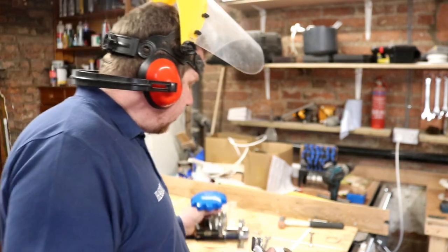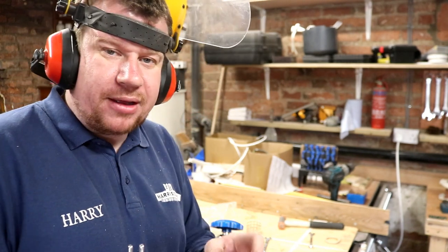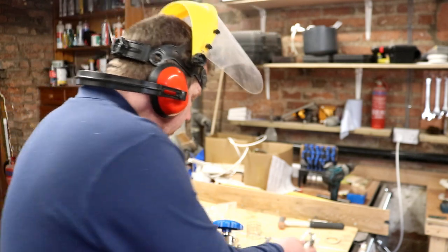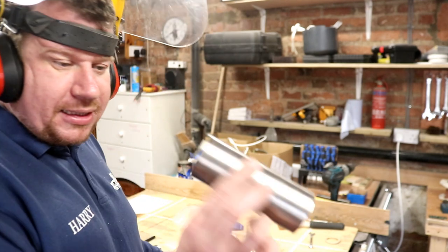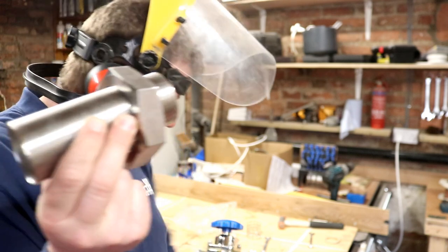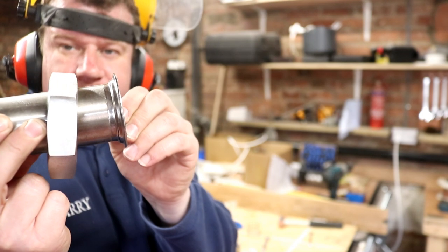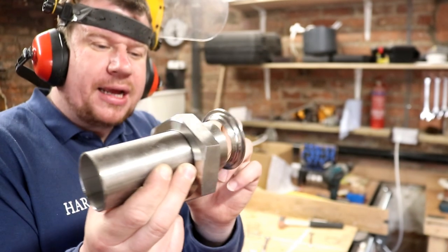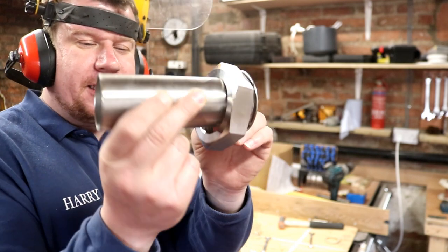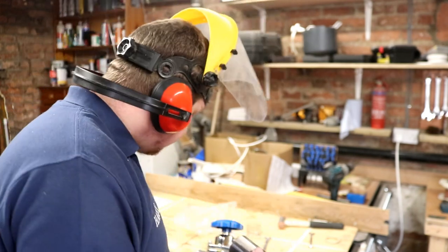And then on the other end of the sight glass, I'm going to install a male RJT, and then we'll be onto 2-inch RJT then. And then what I will use is this little piece of spare 2-inch tubing, and we'll put female, like a liner, and a nut on each end so that we can move forwards and connect using this piece to the tank, and then on the other side to the sight glass.